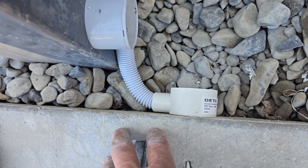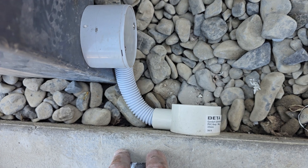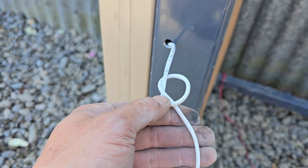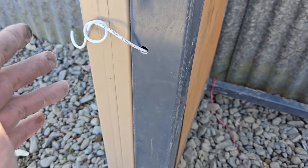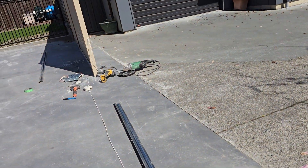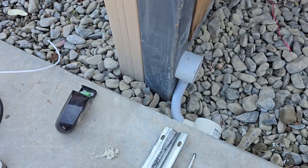You really don't want any of your wires just sitting in the dirt, because obviously someone could hit it with a shovel. The general rule is the safety beams at 600mm high, but because there's a little bit of a rise up there, I've put that one at 550mm high and this one at 600mm.